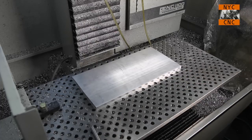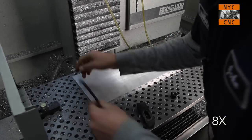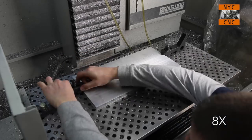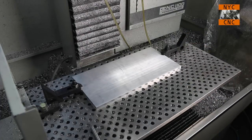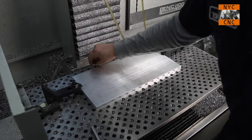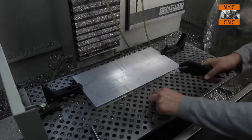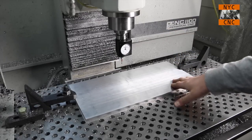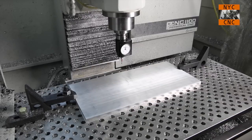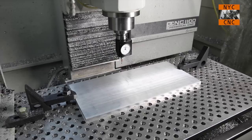So let's now grab a couple of clamps. Okay, we're clamped down snug. We can take our pieces out in the back. Okay, let's pop our CAM program in and take a look at where we are on setup and travels and so forth. Okay, workpiece is clamped down. I ran my indicator over and just sort of got a feel for where we are, and I am going to change it up. If you were concerned or suspicious about just having a clamp on each side, I was thinking the same thing, and I thought, well, let's see how it clamps up and how it feels.